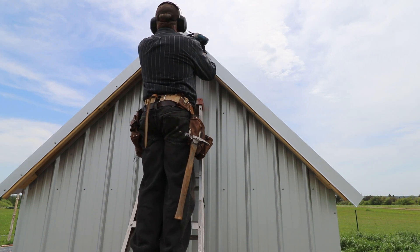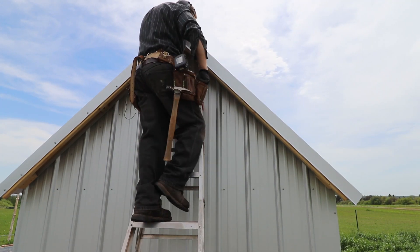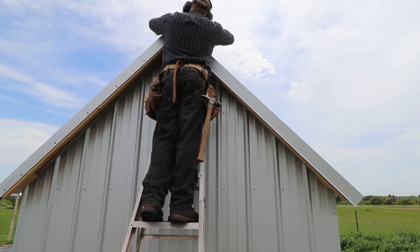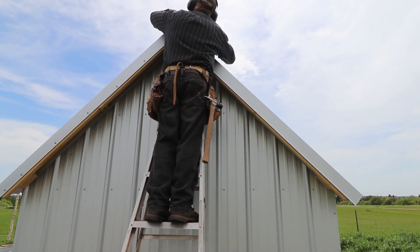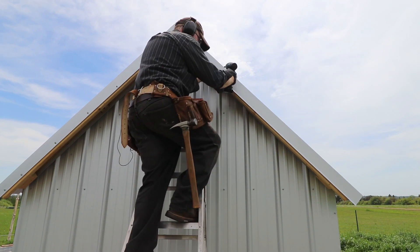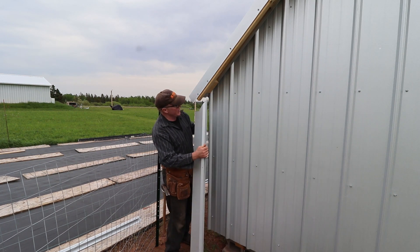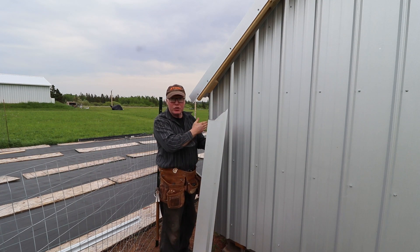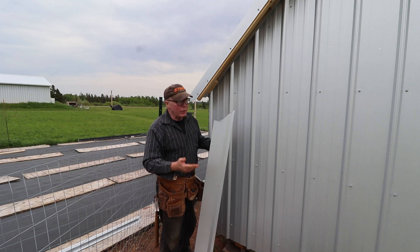It's hard to see but there's a pretty strong wind blowing from the south. The eave flashing is all on right now. Now I'm flashing the corners — the corners get this flashing. It'll go up like here and it does the same job as the eave flashing. It prevents the weather from getting into this joint, seals it nicely, and it'll just make the building last that much longer. I better crack on with this. Hearing protection, as always.